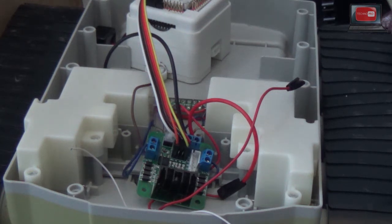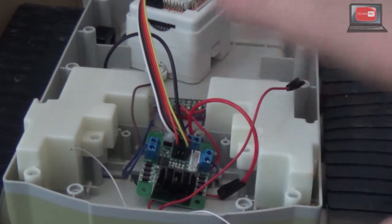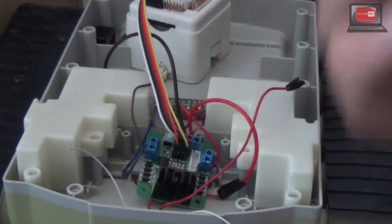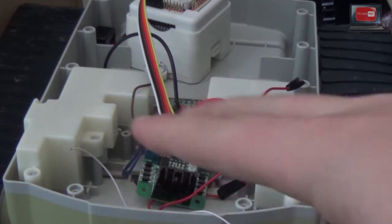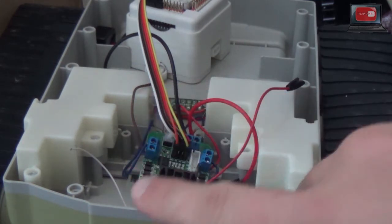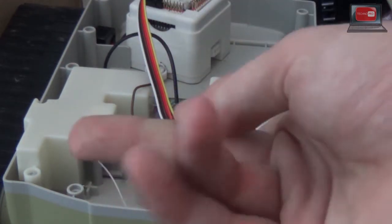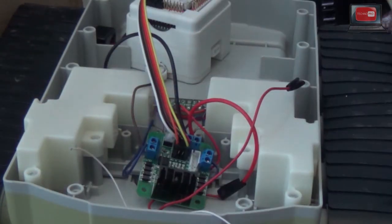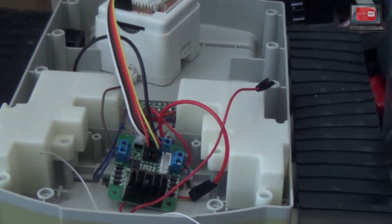As the power goes into them, the motors will slowly flip-flop. The direction that the power is going in will flip-flop, and that allows the motor to keep turning because the magnetic side is now on the opposite side and it wants to touch that side. But then it switches again, and it causes it to go around again. It just keeps switching and slowly speeds up the motor and then maintains that speed. Now that I've talked hardware-wise, I'm going to get over to the current setup.